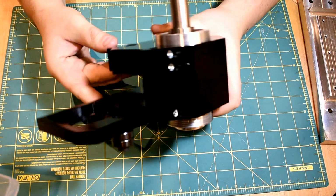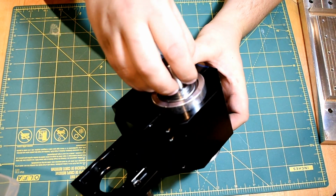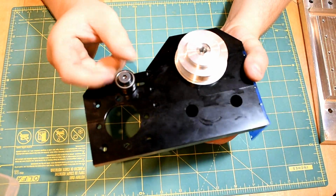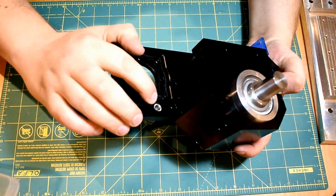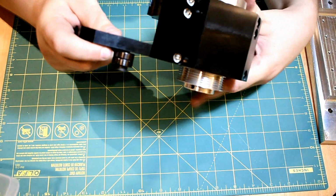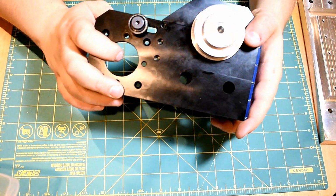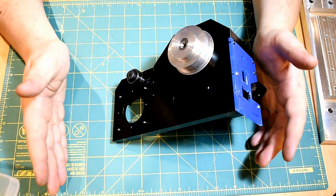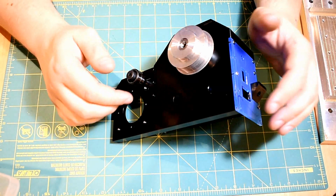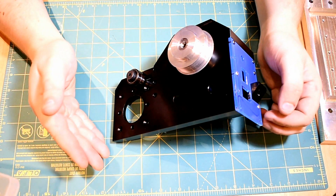So you can see I didn't anodize the spindle cartridge. It's not actually going to get exposed. You won't be able to see it. There's going to be a little cap that goes over here and protects the bearing from chips and things. Next off, you can see I added a groove back here, and I've got an idler system. If you look in there, that's a slot that the nut fits in, and on the other side you see the shoulder bolt and some bearings, and they've got a little washer in there just to protect it. So this is probably a non-ideal implementation of a shoulder bolt. I love shoulder bolts, but this is technically probably a reversible load. If you imagine the belt slapping back and forth, it's going to bend this in opposing directions. And fasteners really don't like bending, so 300 years from now it might break.